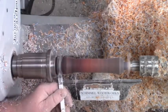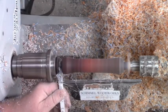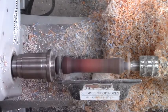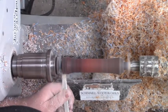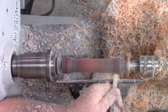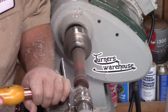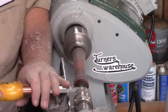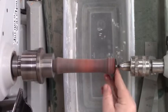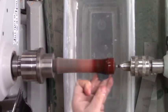It's funny — when I was turning this, I stopped the lathe and I thought I had maybe a quarter-plus inch left. I had turned this thing way down and I was still shaping it. I turned the lathe off and turned around and the handle literally just fell off the lathe — I had turned it down to like an eighth of an inch and didn't realize it. So right here where I'm turning this, there's barely anything holding on. Luckily it was off and it didn't go flying, so I just flipped it around, stuck the cap end with the tenon into the chuck, and sanded it the rest of the way.